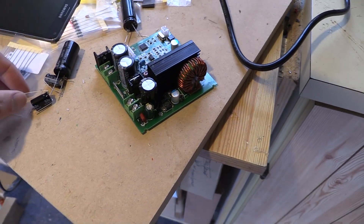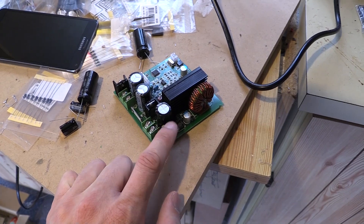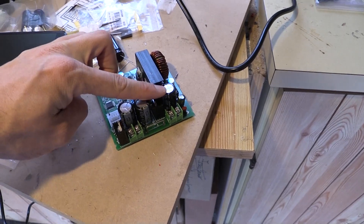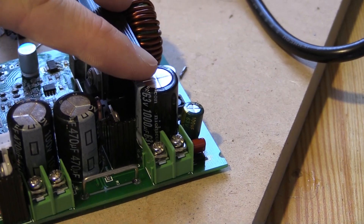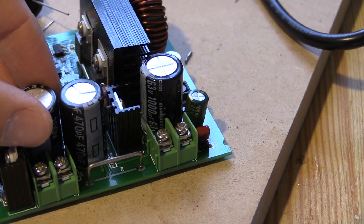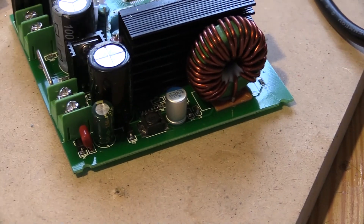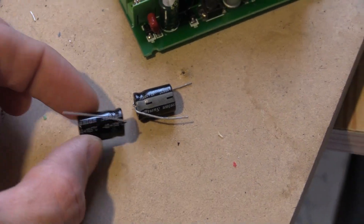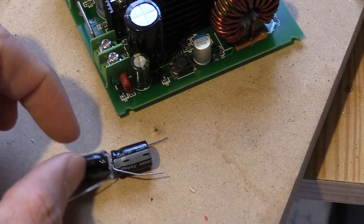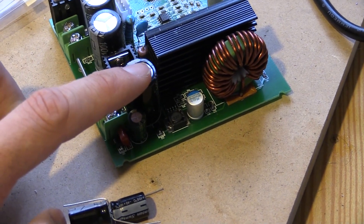That's what I'm going to attempt to do. However, the problem is it's very hard to find 100 volt ones in this size or value. This one here is 1,000µF at 63 volts which is easy to come by, but the 100 volt version is massive and I can only get them in 4,000µF which is about 3 or 4 times the price. So I'm going to replace the smaller one with two in series — it isn't ideal but it's the only way to get a similar value. I can fit two in series in this area, and I can't really go much higher because of the way the box sits around it.